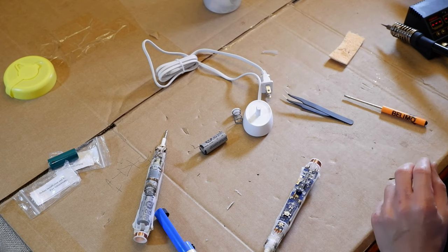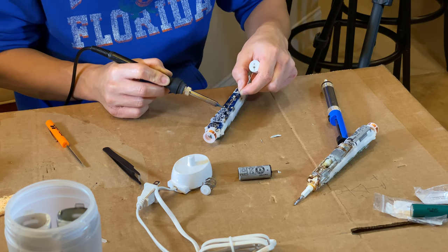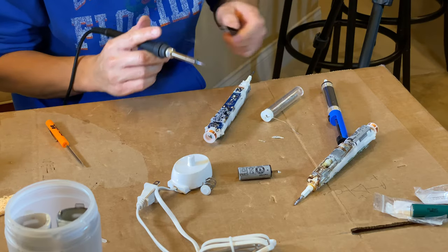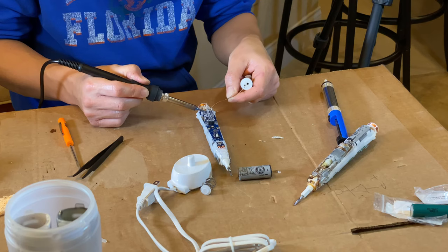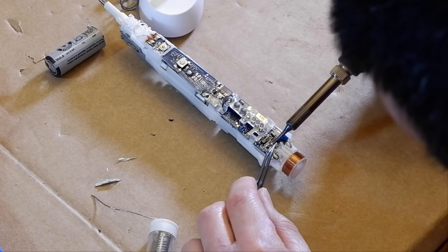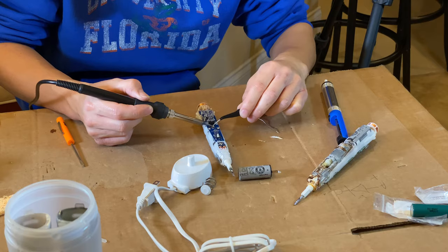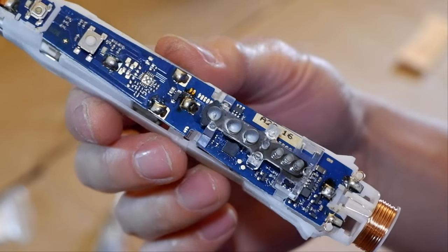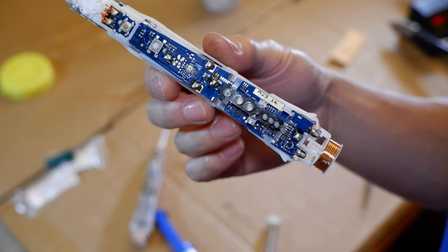Now re-solder everything. Make sure your soldering iron is ready. For soldering, lay the lead on the pad, let it heat the pad up, then let the solder melt on and spread through the pad and the tinning. Use tweezers to hold it down and let it set. Once you get a nice clump of solder on there, heat it back up and use tweezers to let it set in place. Now the battery is soldered up — the little globs look just like the OEM globs. I'll now desolder the corroded one on a time lapse.